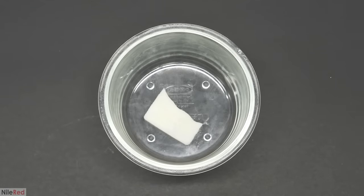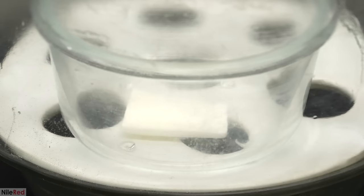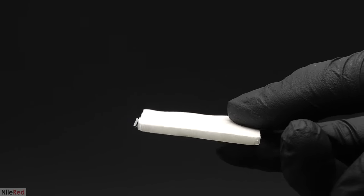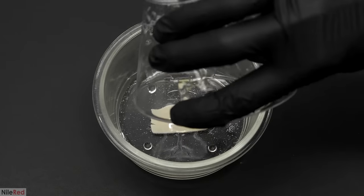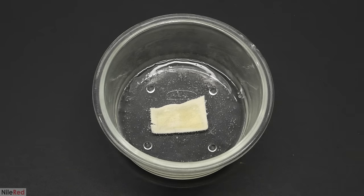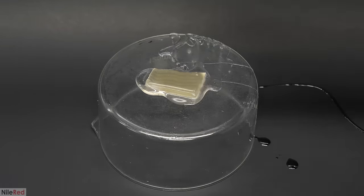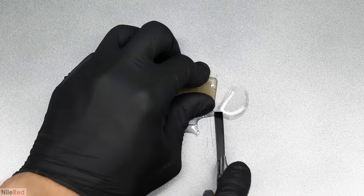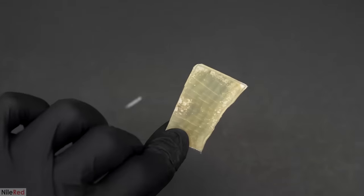To fix this, I thought a quick pre-drying step might work. I put another widthwise piece in the vacuum chamber alone and pulled out a bunch of the ethanol. As I did this, the piece slowly turned white and also shrank a bit. I stopped it when it looked good enough, then filled it with resin using the same vacuum cycle three times. This time I didn't wipe away any of the excess epoxy and actually added extra. When I peeled it off the dish the next day, it was still a bit soft, causing small tear lines. It still wasn't beautiful and uniform like what they had in the paper, but it was definitely the best result I had so far - and this time I was actually able to read what was on the other side.